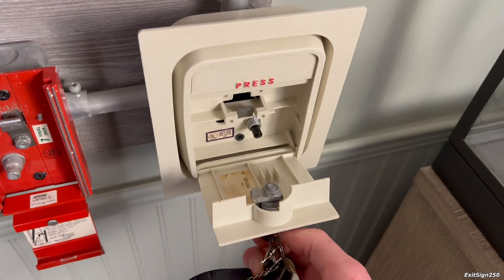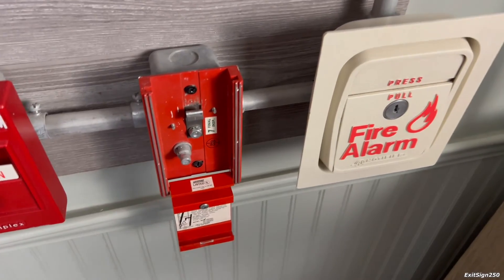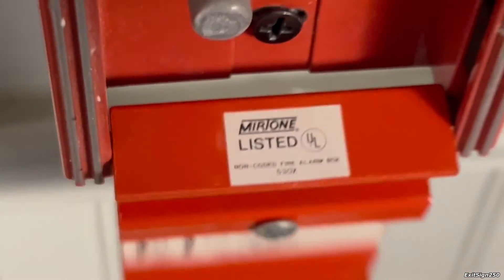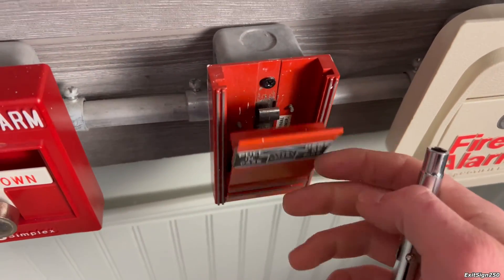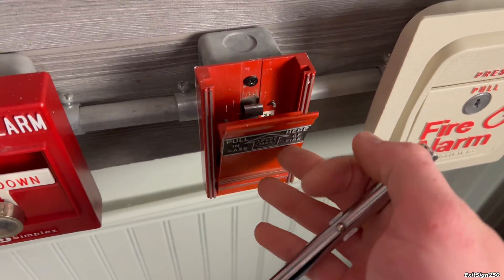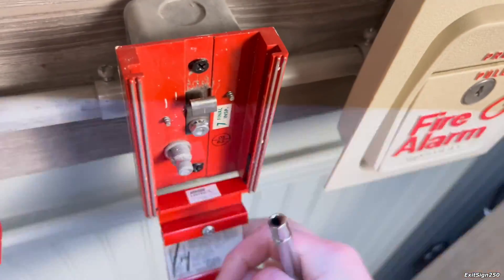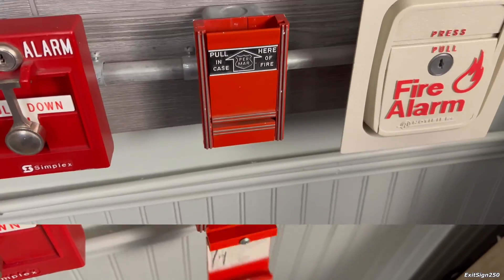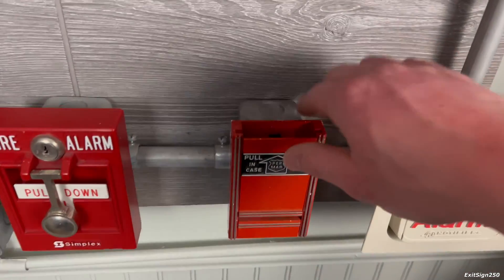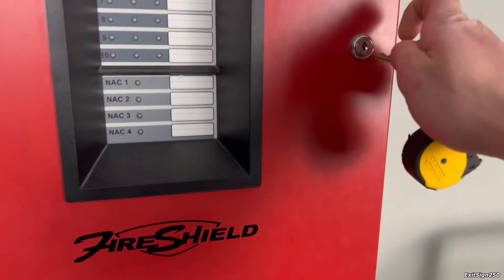It's a lot like a Notifier BNG1, just plastic and dual action. And now let's reset this. There's the Mirtone name — that's neat, I never noticed that before. Resetting one of these involves putting a flathead screwdriver and prying the little bar to reset the handle back into position. It's seriously a pain to reset this pull station one-handed. And let's reset the 10-zone system now.